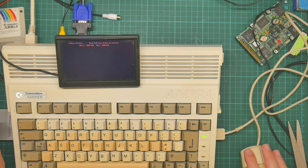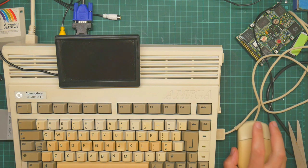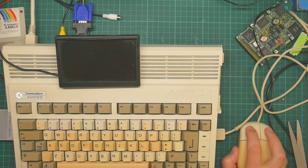Software failure — press left mouse button to continue. I'm hoping that this is a problem with the hard drive, which is configured for AmigaDOS 2. So see if I can actually make it boot properly. You have to press both mouse buttons to force it to boot from floppy.